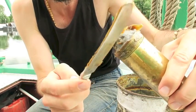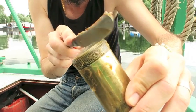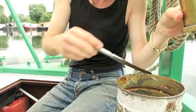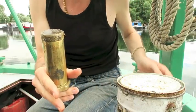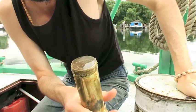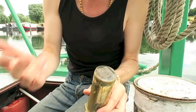So the best thing to do is just to use your butter knife to make it flat — maybe just a little bit more, like that. Once you're done with the grease, make sure that it is all put away. Just a slight footnote: buying marine grease this size will be quite expensive. I'm not sure whether you can buy it in different sizes, but make sure you get a good quality marine grease. If you're buying good quality materials for your boat, it's going to last.